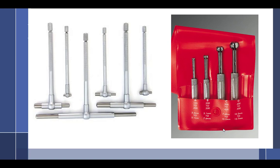When you're measuring a cylinder, each manufacturer is going to tell you to measure a little bit different. I'm giving you a Continental cylinder with the Continental instructions, and you're following that. We're not doing a whole bore inspection, I'm having you do basically one spot. Normally I'm going to do one, then an out of round. So I'm going to measure here, here, then here, take the difference, that's my out of round. Then I have to measure all the way down here, at what would be the bottom when it's facing this way, which is really the top.